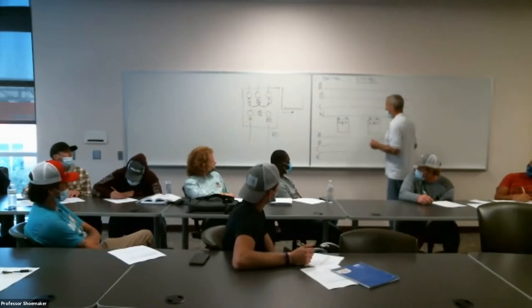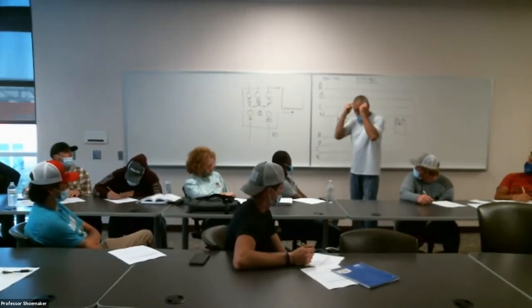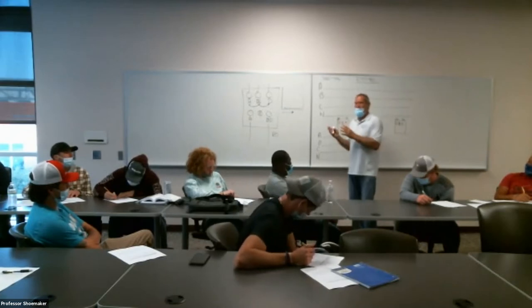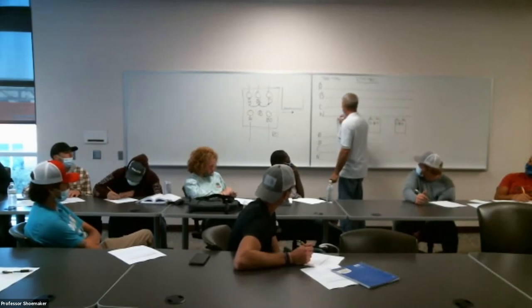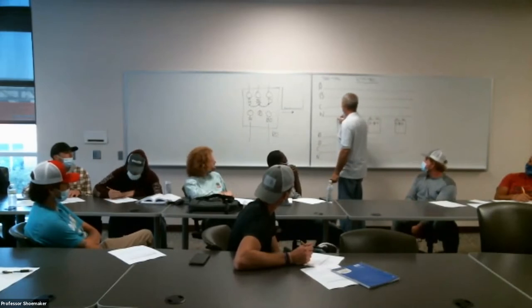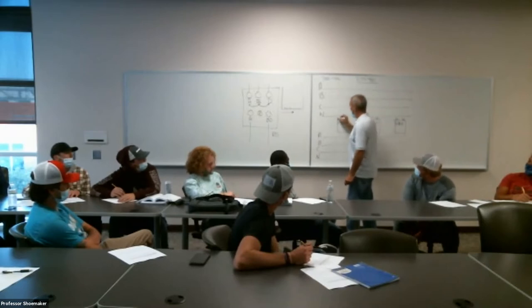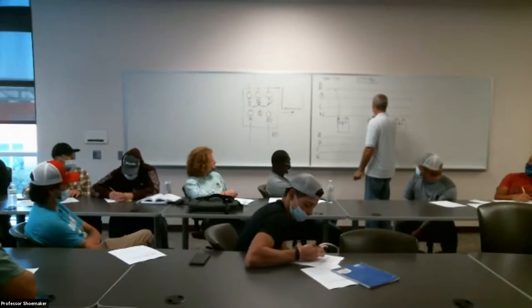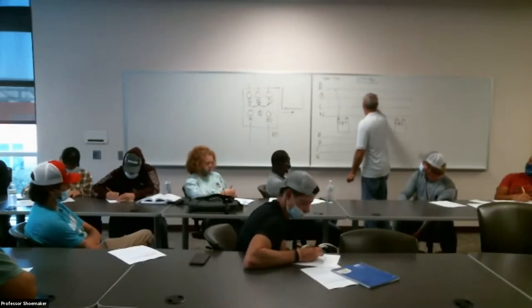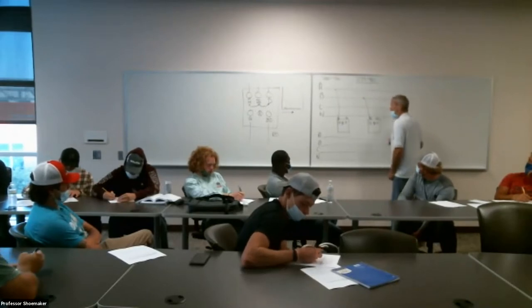Okay, so I got all my transformers ready to rock. This is my logic. I like to work left to right, and I like to work with the alphabet. Which connection am I going to take this H1 to? H1's already there. Where do I go? A. How about H1 on this transformer? B. Yeah, go with the alphabet. And how about H1 on this transformer? Mm-hmm. That works for me.